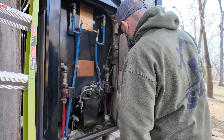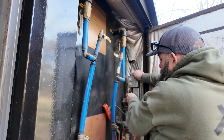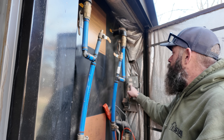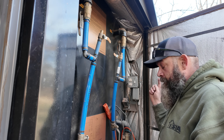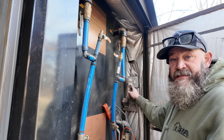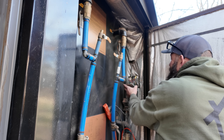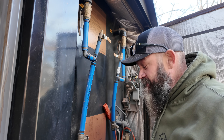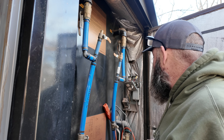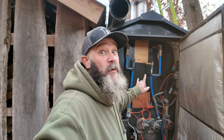So I'm going into this box — this is the main power box for the unit. This is what fed the fans before. We're going to plug one of the green cords in here to feed the Boiler Commander and then it will pass through and feed the fans. This switch kills these outlets and this power feed coming out, but just because you turned that switch off, the line coming in from your breaker box is still live. Don't decide that because you flipped the switch off you can stick your fingers in there — you should not.